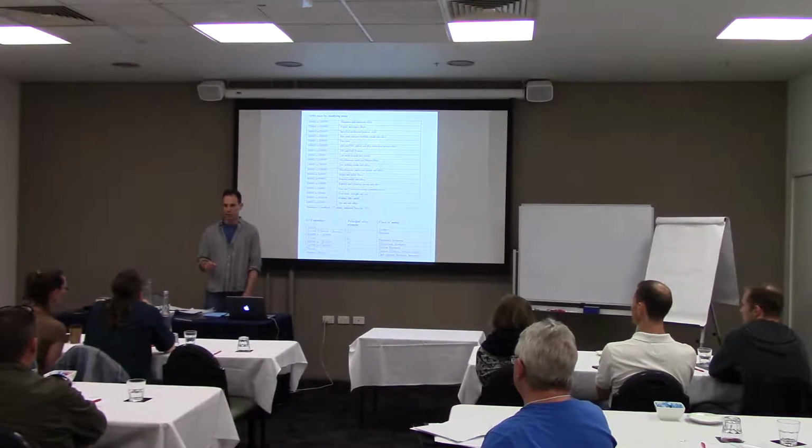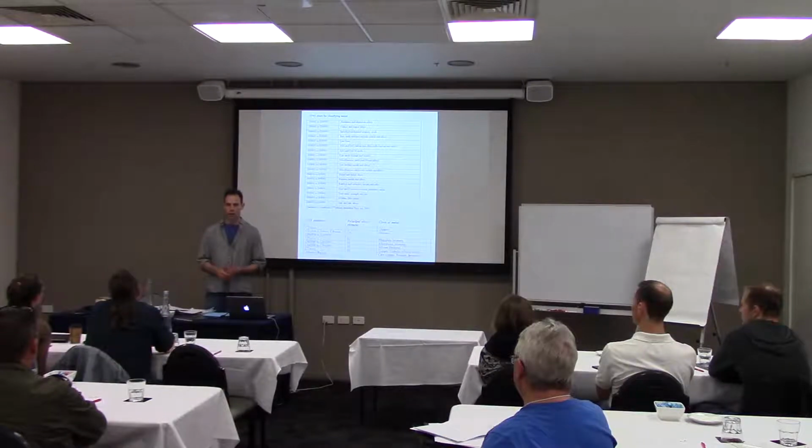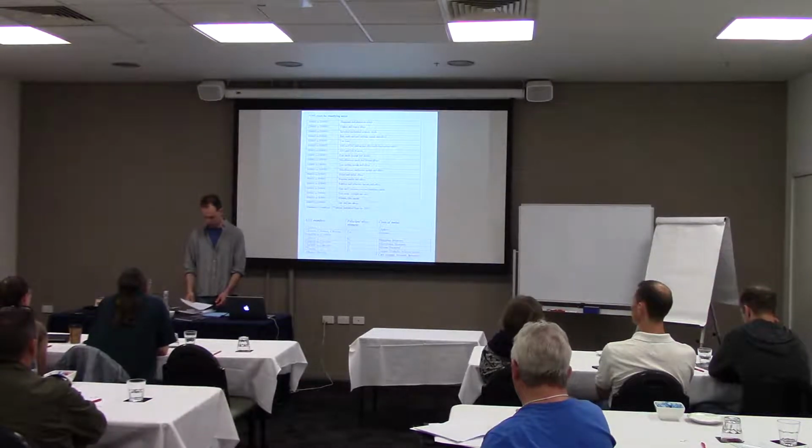Fine silver, or pure silver, is 99.9. There's always going to be a trace of something in there. We use that for plating primarily, because it's too soft for making instruments out of. You need a little bit of rigidity, a little bit of copper in there. So that kind of explains that. If you see silver bells on saxophones or trumpets or whatever, that's some sort of sterling silver.